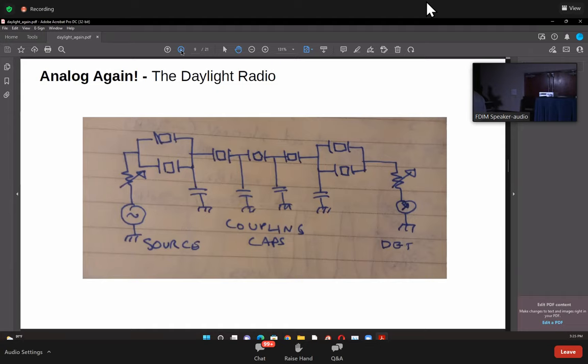So at 5 megahertz, the beauty about 5 megahertz is that the impedances that are achievable are 1K on both sides. Okay, 1K impedance. Now, I'll just take a small diversion here, which is that a lot of hams on our forum ask, how do I measure the impedance of my crystal filter? There is no impedance for a filter, okay? A filter will exhibit different and very weird pass bands at every impedance. So you choose an impedance depending on the pass band you want that filter to exhibit, right?